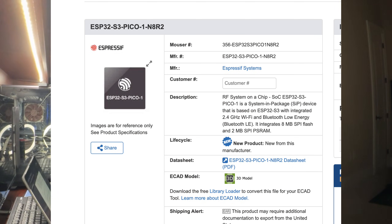Looking at the next three iterations, I definitely need to make this a lot smaller. I'm thinking about using a double-sided PCB to take the current components and cut them down to roughly half the size. It would also be cool to have the camera and ESP32 on one side of the glasses, and on the other side the battery, battery management system, and an SD card slot — which would mean I'd need to 3D print my own glasses frame. I might also try using the ESP32-S3 Pico, a smaller module that still supports 8 MB of pseudo-static RAM. I also tested the OV5640 camera, but because of the heat it generates it creates a lot of noise in the output image, so I may need to design a passive cooling solution for better thermals.